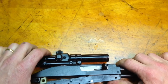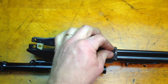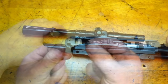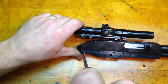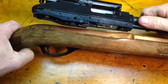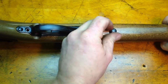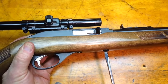I've got that put back together and it operates real well. My next thing is the trigger assembly — I'll put that up into the barrel. I'm going to start by putting my two front screws in, not real tight but snug, because the trigger assembly is going to pivot back and forth on them until I get the back bolt in. You can see how it pivots. This one slides all the way through, then I turn the gun over and put the short screw in on the other side. Once I get that done, I'll tighten all the screws, then I can come back in with my stock — set the barrel inside the stock and replace the two screws. I start them by hand to make sure I don't get them cross-threaded, gently get a couple threads started, then tighten up the screws.